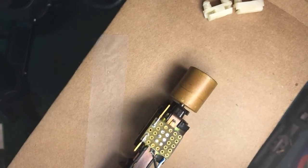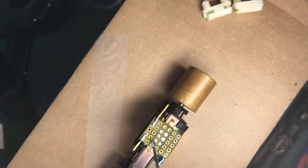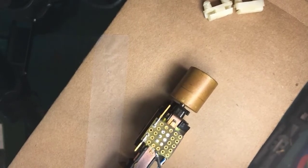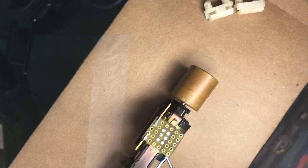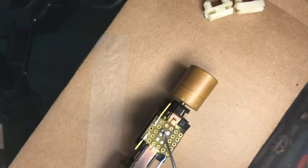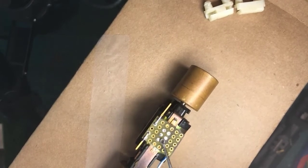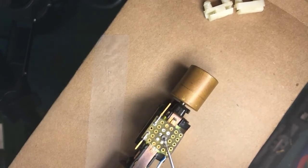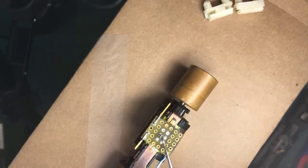I fluxed it and put a bunch of solder there. Then separately, I soldered these pads, then held the two together firmly and heated the bottom of the clip such that these six pads are now soldered solid to the clip. This of course means I have a point to connect electricity to the top of the motor contact.